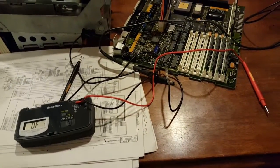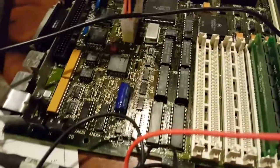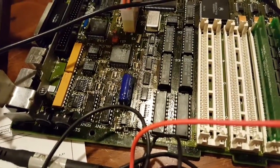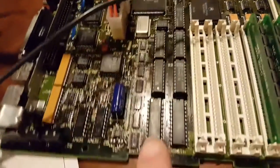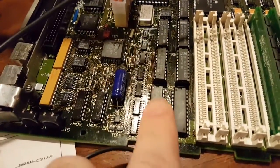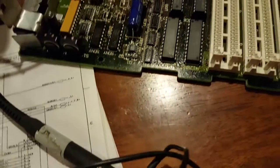You never know. This goes to show you — don't rule out anything, you always have to check. UE8 is not bad. However, this RAM chip likely is — it's shorted internally. We're going to find out if that RAM is bad or if there's a short somewhere in the ground plane to that pin. This is pin 24, 23 — pin 23 on UC7, video bit three.